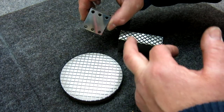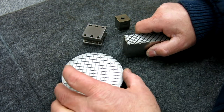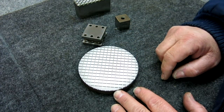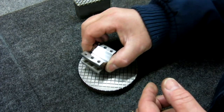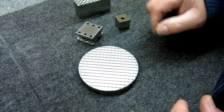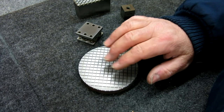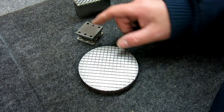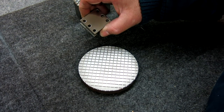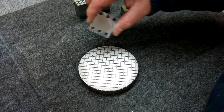I used this guy here for the flat surface — this is a commercial cast iron lap. I did the flat surface on this one. On this one I went straight to diamond — three-micron — and then finished with one-micron on that one. So let's evaluate this surface and see just how flat it is.